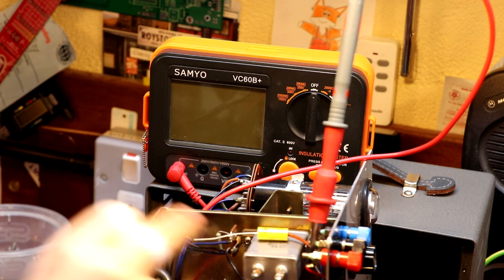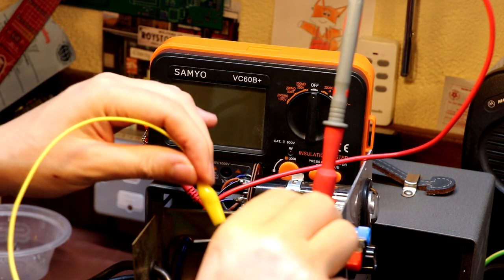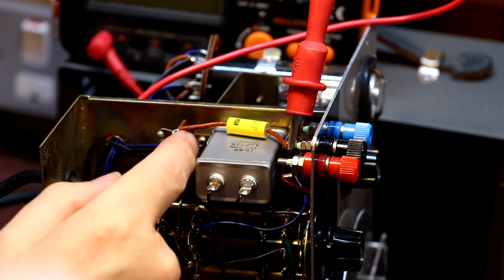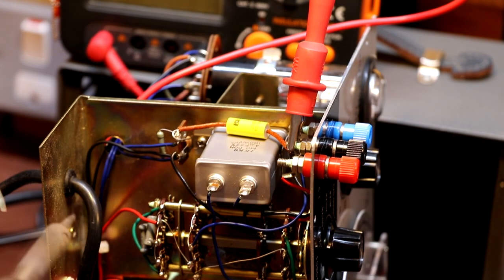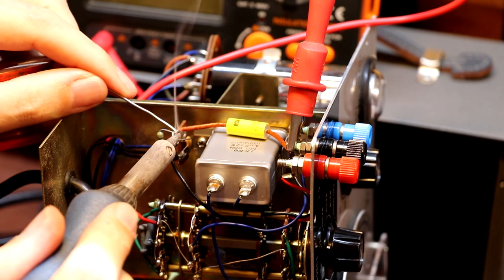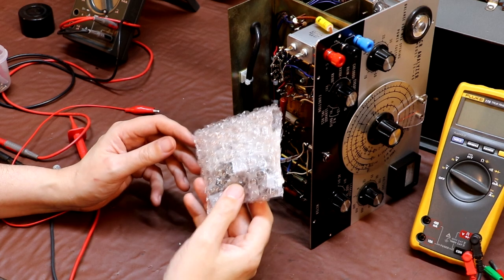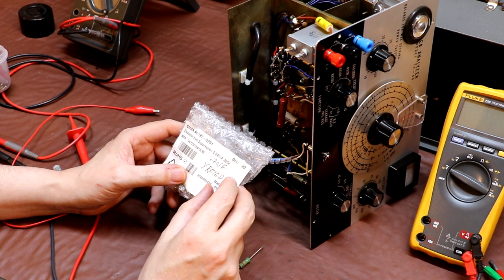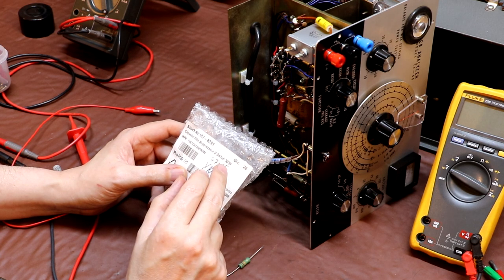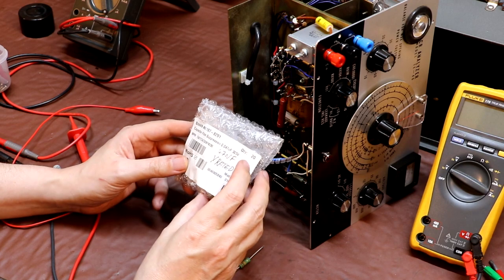I'm sure most of you are waiting for me to touch the end of this capacitor because it will almost certainly be charged up — yeah, little crack there. I did manage to track down some Y-rated capacitors in the end, though it certainly wasn't easy. These are actually Y2 class, so they're going to see about 250 volts in operation, and they have an AC working voltage of 305 volts. I would have liked something a little bit higher than that because you never know what kind of transients you've got on the AC line.